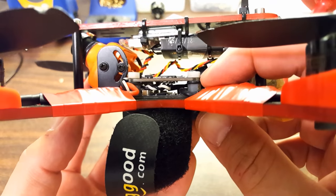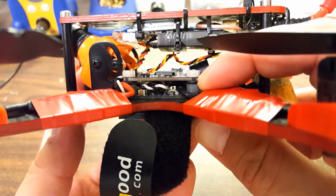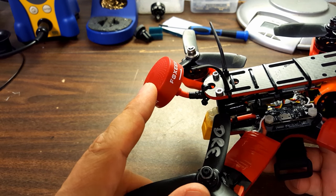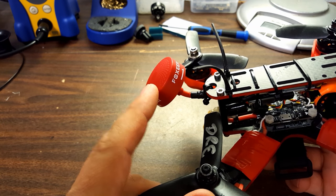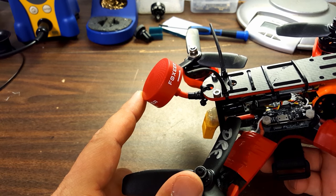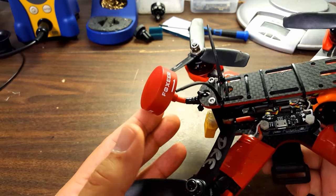You can see the flight controller has been placed on vibration isolation O-rings. There's some question as to how effective this really is since vibration can still be transmitted through the screw, but it is a nice touch that shows the builder is really thinking through all the details. The Foxeer antenna here is a pretty solid choice — it's not going to match something like a TBS Triumph in RF performance, but it's a solid choice with acceptable performance at a good price point, and they're pretty durable.